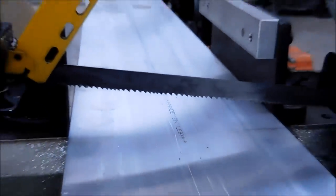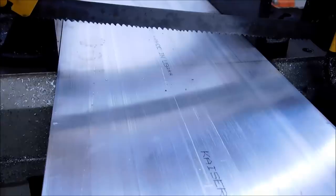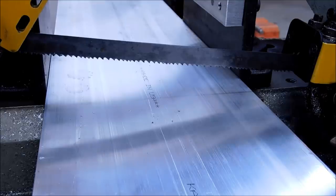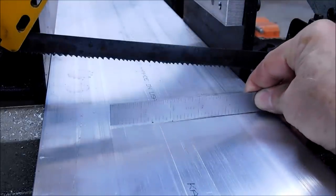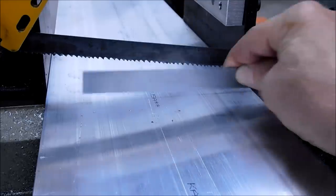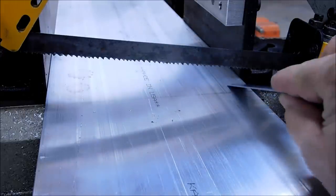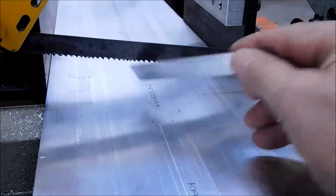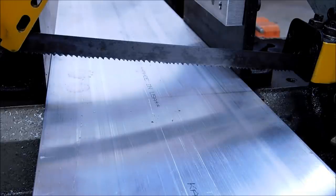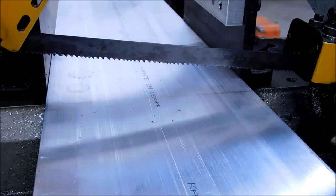What we're going to do is cut this three different ways and show you the difference in time cutting a piece of plate like this. Because of the geometry of a horizontal machine, it's a hinge that comes down. The movement on one end is more aggressive initially, but as it starts to level out it comes down parallel. It should tear through about the first three inches relatively quick, but when it levels out it makes contact with a full eight inches of 6061 aluminum.